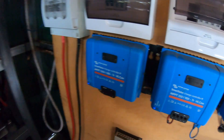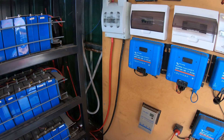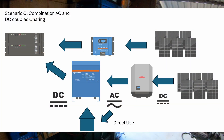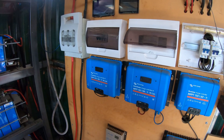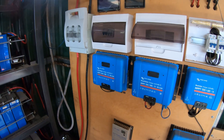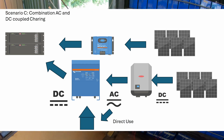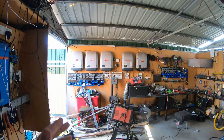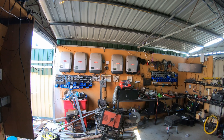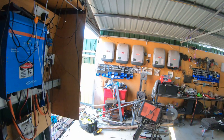When you're charging the battery, DC is the most efficient way to do it. But it's not necessarily the most efficient way to directly use the power. So you've got two situations: if you've got loads running during the day, the most efficient way to get AC power directly to them is actually from the AC coupled PV inverters, not through the battery and inverter chain. That's the part that gets overlooked — everybody says it's not efficient and you should use MPPTs to directly charge the battery. Sure, for charging the battery that is the most efficient way, but it's not the most efficient way to directly use the power.